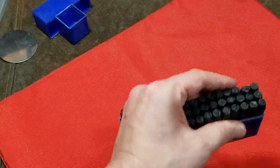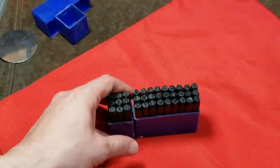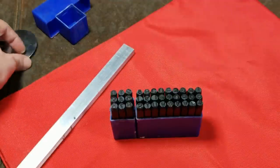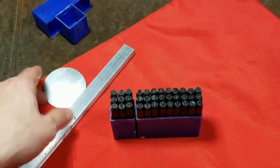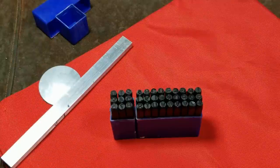You would tend to want to use a heavier hammer like a fuller or a two-pound hammer. In my little demonstration in this video I'm going to use an inappropriate claw hammer, but it'll be fine because I'm just doing soft materials like aluminum and sheet metal, and I'll show a couple of the techniques I've learned about working with both thicker and thin cross-section materials.